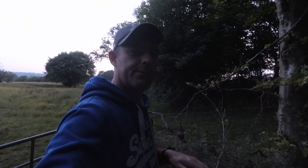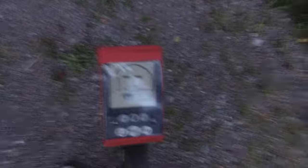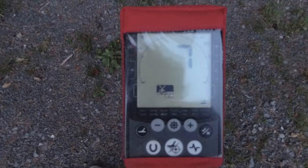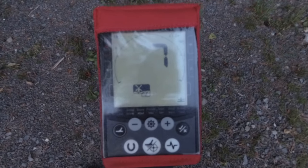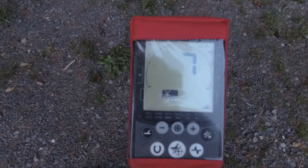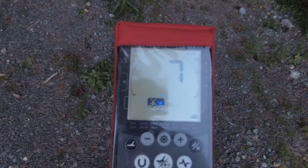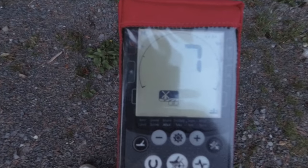I find it runs best around 20 to 21. On the beach, you do need to reduce it a little bit more, but in the majority of fields you're looking around 20 and it runs quiet as a mouse — beautiful machine, extremely light. Now, let's show you how to alter the recovery speed and the threshold. So you go into settings and move it right across to recovery speed. Recovery speed is currently set at 7 — 8 being the highest. A quick overview on recovery speed: the lower the recovery speed, the deeper the machine will find something. However, if there's a lot of trash and a lot of iron, it's going to make a lot of noise, give you loads of false signals, and it'll be a nightmare. So if you're in a really trashy area, you want your recovery speed set quite high. You're still going to get down below 5 or 6 inches, so don't worry, but you might miss out on the really deep targets.